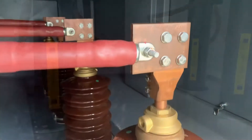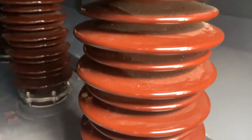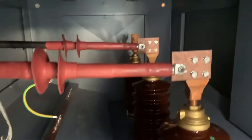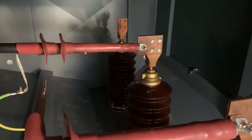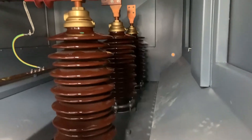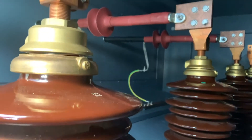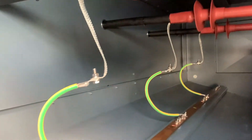So what don't we want to see when we do our final inspections? This is another 33 to 11 kV transformer and here you can see the amount of dust and debris left within the chamber itself on the primary side, and all the build-up of dust on the insulators. The concern here is that with moisture in the air this dust will become wet and it could cause tracking on the 33 kV insulators, ultimately leading to a fault.